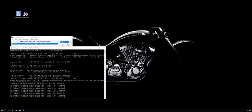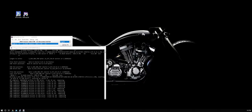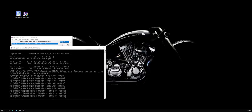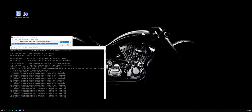Also, I'm always playing around with slicer settings. I'm always trying to find the perfect, well, there's no perfect slicer setting. But I'm trying to wrangle in a few things that I've been dealing with, mainly under extrusion. One of the things I've noticed with Klipper is the step rate is so accurate that at 100% extrusion multiplier with 1.75 for my filament, it's under extruding just a smidge, and that under extrusion is because my filament is actually 1.70 to 1.71. So, I've been playing around with just changing the actual filament diameter to what the filament actually is, and guess what?